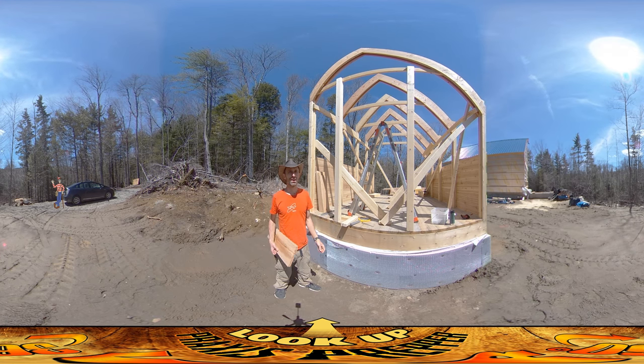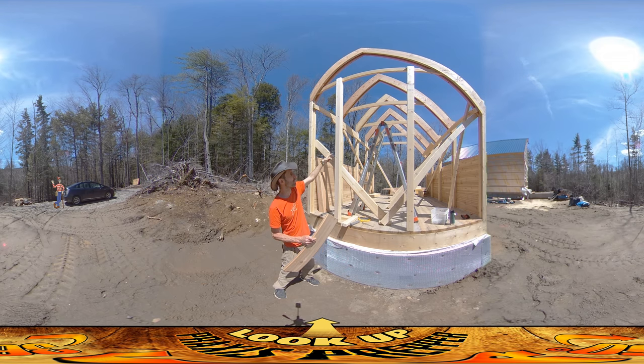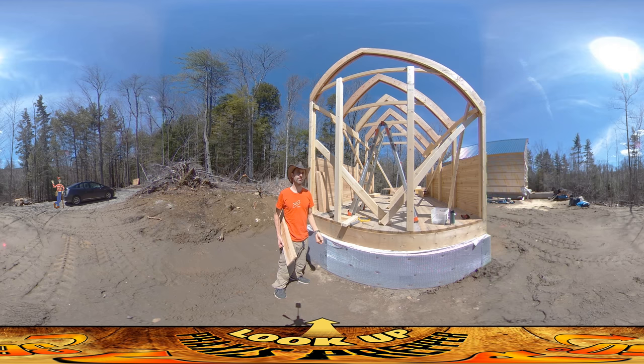Even if it's super windy, if I know I want to have the window 1 foot to the left of the mark, I can just use the mark on the top and the bottom and figure it out. So if you are in a situation where you need to take plumb bob measurements, take advantage of when, like right now, the wind stops, make your marks, and then if the wind picks up later on, you already got your marks, you don't have to worry about it.